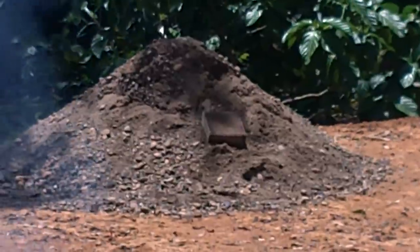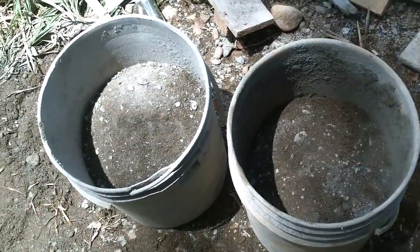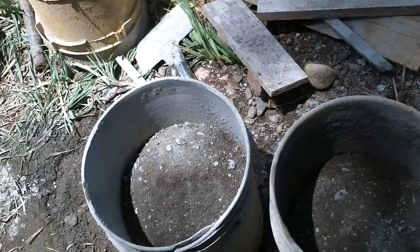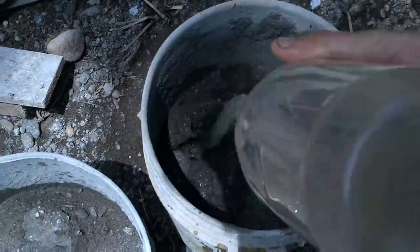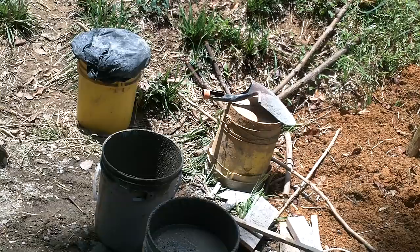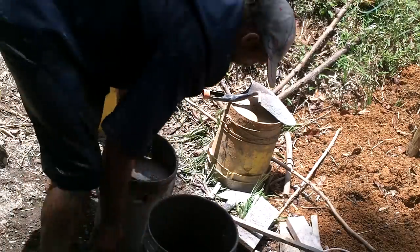I got all the rocks out so I'm basically down to sand, and I've mixed about four parts sand and one part cement — there's my bucket of cement, kept covered so no water gets in. That's going to be my spackle. I'm making it pretty wet because the wall is going to suck up some moisture right away. That is definitely soupier than you'd want concrete.